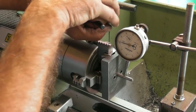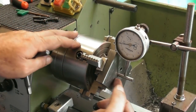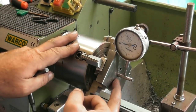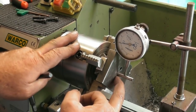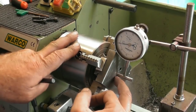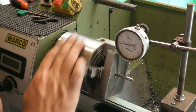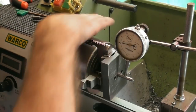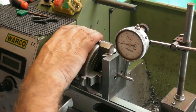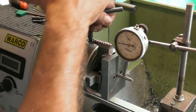See if I can just... And obviously I've pushed the dowel. Okay, I've popped the dowel into the end of there. That's the 6mm dowel I was using, into the 6mm dowel hole in the bottom. And I'm clocking up so I'm centre about on the centre of the dowel hole, as it would have been originally. So very nearly there now. So the high point there. Oops.